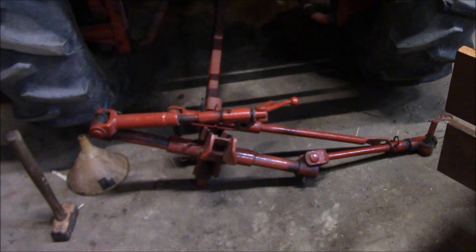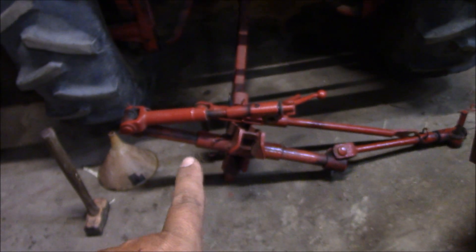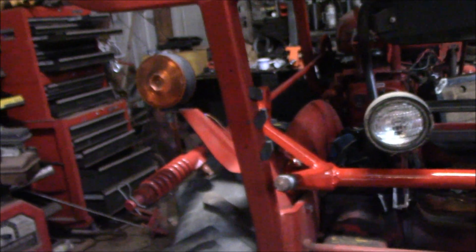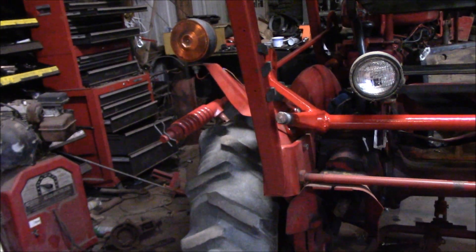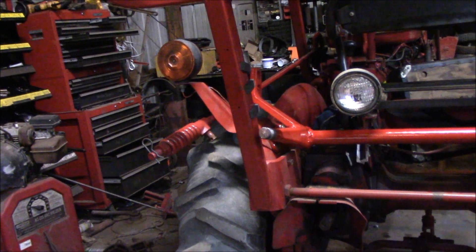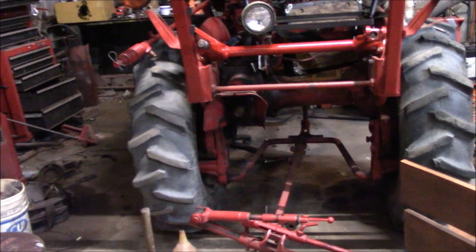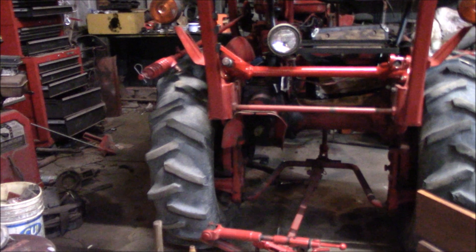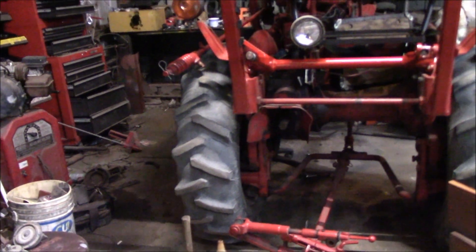You've got joints here, here, here, and here — it's just a lot. It was great for the time, but they had kept it a little while longer — the fast hitch was exceeding its capacity. The weight of the implements was exceeding the fast hitch system. A lot of people think, why couldn't they have put fast hitch on the 1066s and up? Well, if you look at implements today — twenty foot wide, fifteen foot wide — the one-point system had its limits.